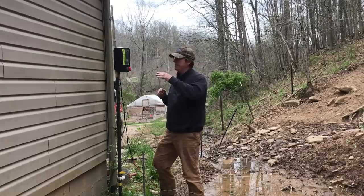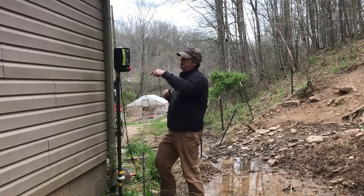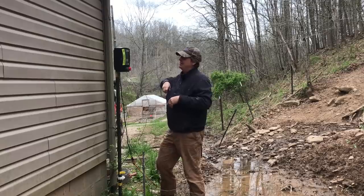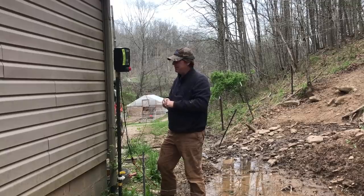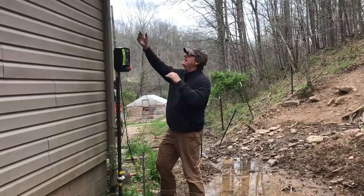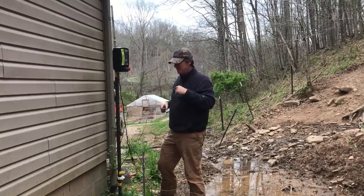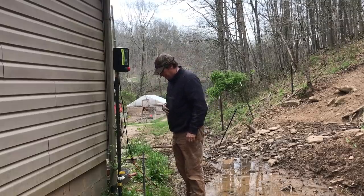And as I'm sure you guys are aware, anytime you're buying an Energizer, look at the joule rating. Don't look at this foolishness like this says, powers up to 200 acres or 80 hectares, whatever. That's all relative. What you want to see is the joule output, and that's really going to determine the potency of the Energizer. Anyway, had this thing forever. It works great. It's even kind of gotten out from under the cover. I had it leaned up against my building there, and you're really not supposed to have these in the direct weather.